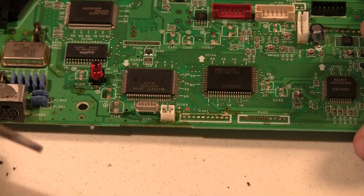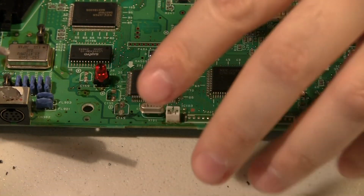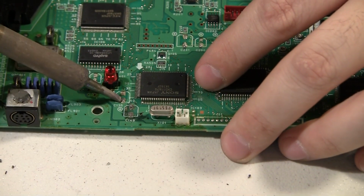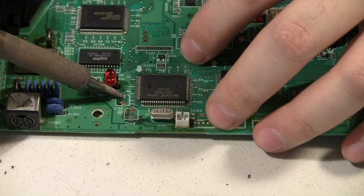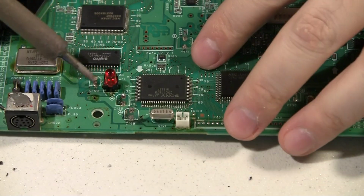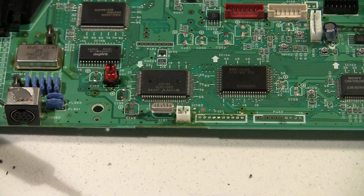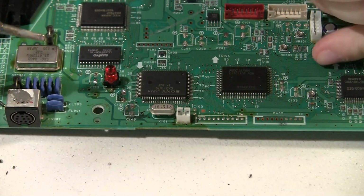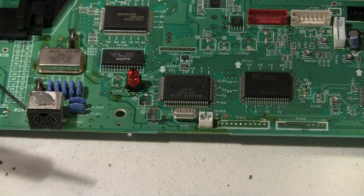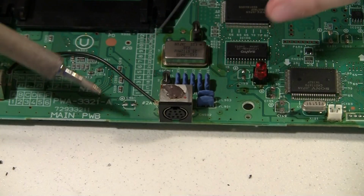Now, I like to go back and run the soldering iron over each pad, because usually there is a piece of leg still attached to one of the pads. And just push it off. Just like that. And after I do that, I will go back and also solder on, or add some new solder to each pad, because we are going to solder on leaded caps.